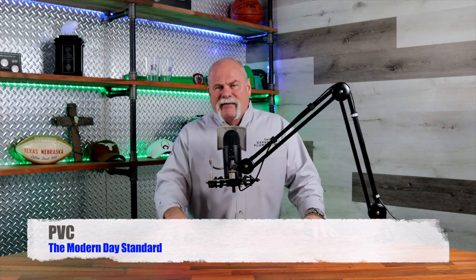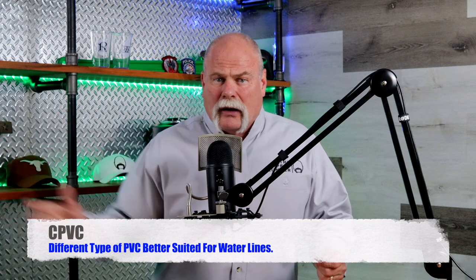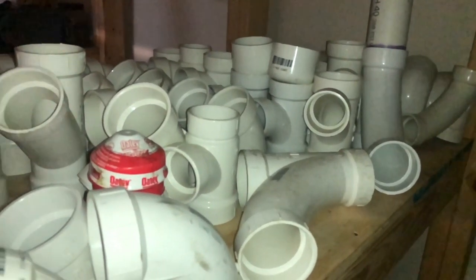PVC has multiple uses. It's used in rural areas as a potable water supply system, though really CPVC — chlorinated polyvinyl chloride — should be used instead. CPVC is chlorinated so it can be used for potable water. Locally, we use CPVC for hot water, such as a discharge line on a T&P valve on a water heater. PVC replaced cast iron pipe underground and in the walls, and is used in some commercial buildings as long as it's not in a common space where PVC fumes could become a fire hazard. With PVC you've also got to consider fittings: DWV fittings for drain, waste, and vent, versus pressure fittings for water supply or irrigation.